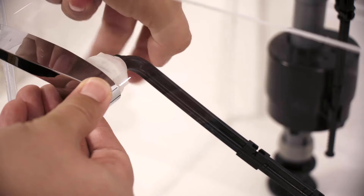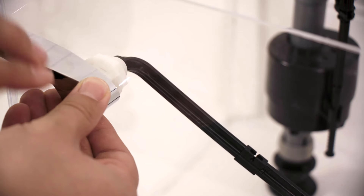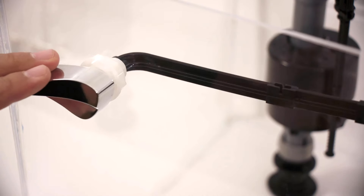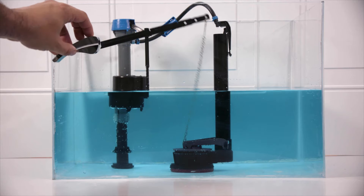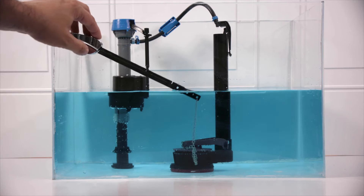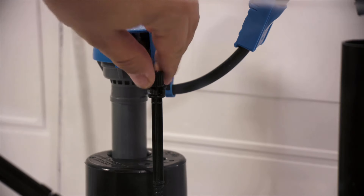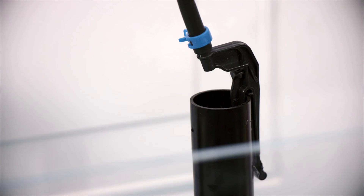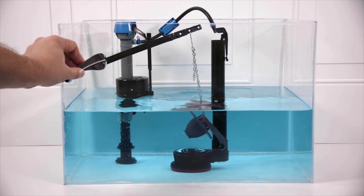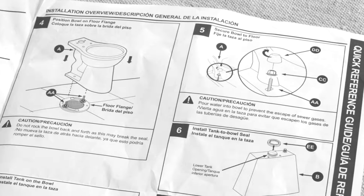If the toilet won't flush, check the flush handle assembly. Often, the nut inside the tank can be loose and can be easily tightened. If the chain has come off, you can repair or replace it. If it doesn't flush completely, make sure the chain is not too slack and adjust as needed. In most toilets, you can adjust the float to get more water in the tank, so make sure the water level is about a half inch below the overflow pipe. Adjusting components might not be the same for all toilet models, so check your manufacturer's instructions before you begin.